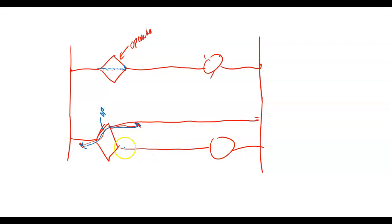Now the leakage current now is leakage current. So basically, that leakage current we measured before would be the minimum operating current. Over here, though, the operating current is fed through here. So what we measured here is 1.8 microamps. What we measured up here, I can't remember. It was either 300 and something or it was 600 and something, but it was still microamps. I can't remember. I have to go back and look. Y'all were supposed to record that.